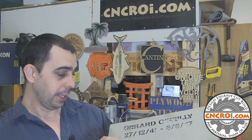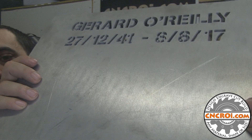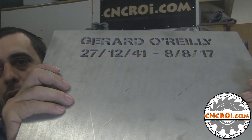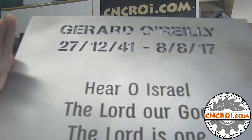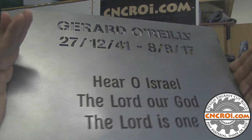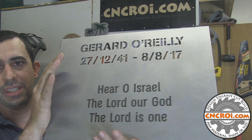The positive aspect of having a junky plate is that you can take a look at the surface finish. Here's the surface finish from the water jet or from the supplier — it's a matte gray, nothing crazy, just a couple of scratches here and there. The plate that came out good has a slightly different finish because I like sanding my stainless steel plates. I'm not looking for super bright shininess because if it's too reflective it's like a mirror burning into your eyes. I want to keep the dull finish but give it a little more texture, which increases contrast and makes for a more consistent result.